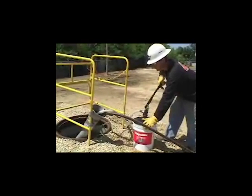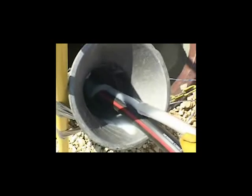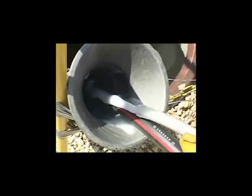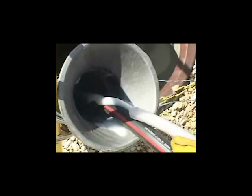Controlled pumping of Polywater lubricant provides consistent lubrication and avoids the mess with hand application. The best pumps are designed for water-based materials and pump a broad lubricant viscosity range at acceptable flow rates.